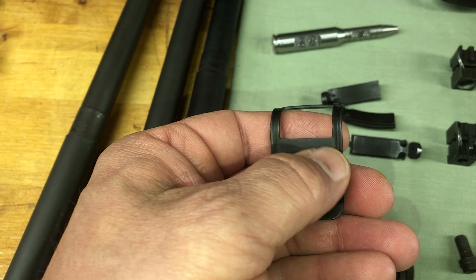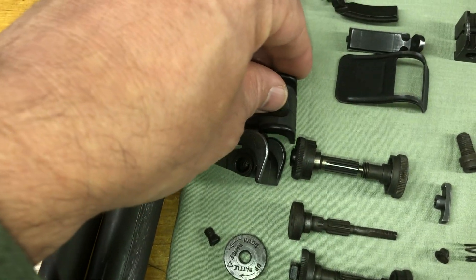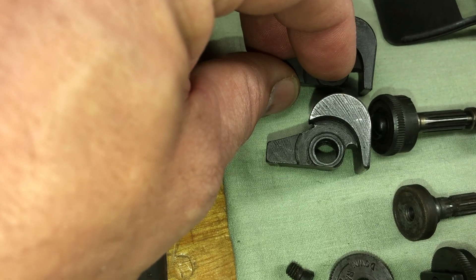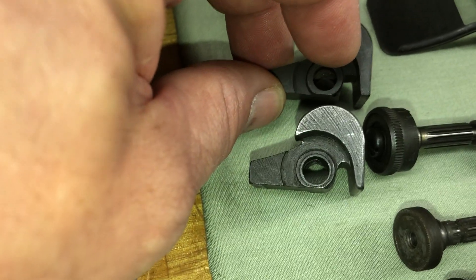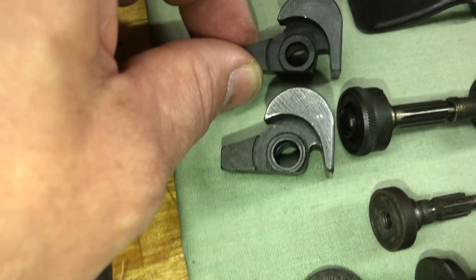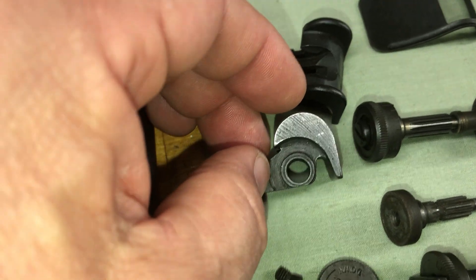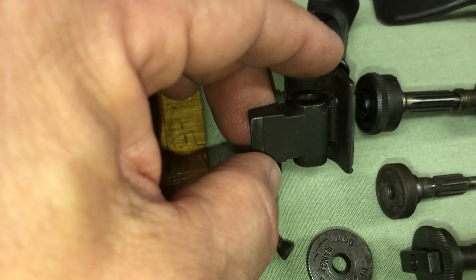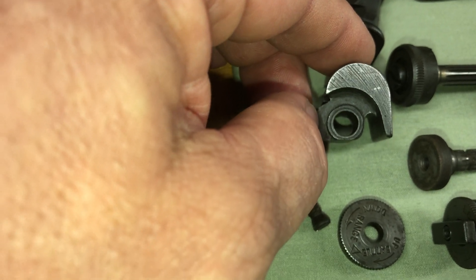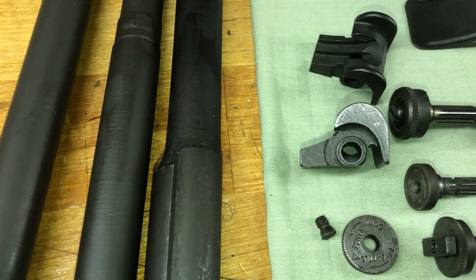Covers - are they marked or not? Do they have a punch mark? How big is the ribbing? What color are they? Note that. The bases themselves - looking at the angle right to the bottom right of my finger - that's a nice angled one. The one below that's a Winchester; it's got a punch mark next to it on the outer left ear. It's arc - that's a Winchester, you can tell by the chatter marks too. Early stuff was part-marked on the very bottom, but that's only for a C-code - if it's C with a number, that's gas trap type stuff. Concentric circles is another set of cut circles deeper inside the rear sight base.